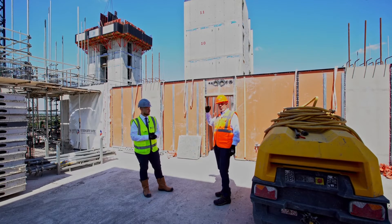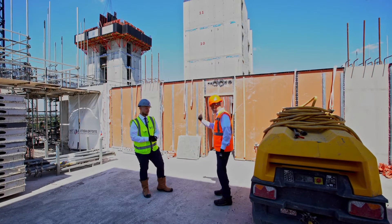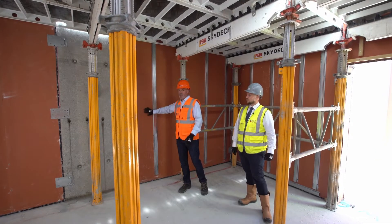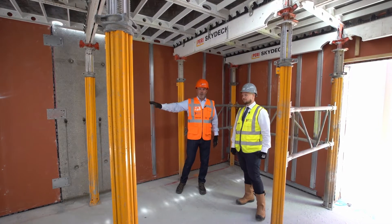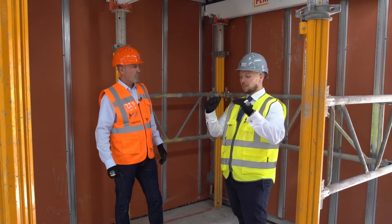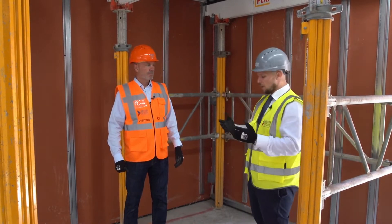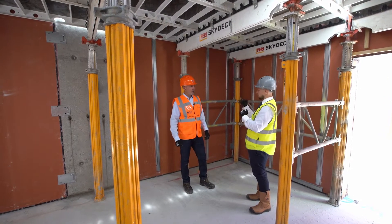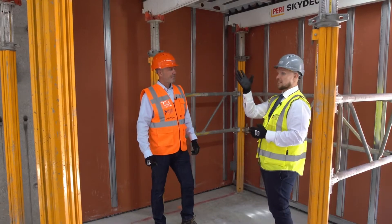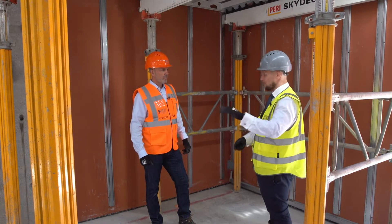Let's go inside and check out the floor system, and then go up top so you can see it from above — it's going to tie together this whole system. Now we're on the inside. You can see the uni-wall here and uni-panels on this side with the exterior doors to the patios and windows. What we're looking at with all this structure in here — this is all temporary. What we've actually got here is the formwork, the decking system. They'll pour the concrete slab for the floor above on top of us. It's an important part of the system because we've created that permanent formwork on the head of the uni-panel, and the flange on the head of the uni-wall — this effectively ties it all together and creates that trough that the concrete is poured into. Once we've got this decking system in place, it's just a conventional process of concrete reinforcing bar, and then they'll fill it up with concrete, poke it, flatten it all off, and it's good to go.